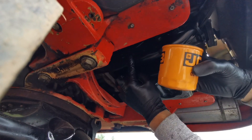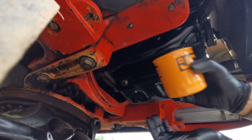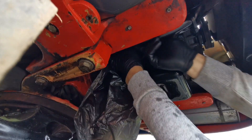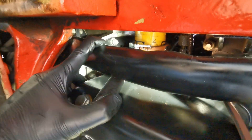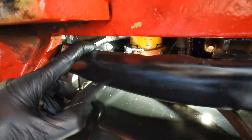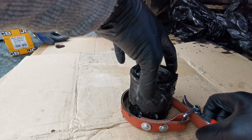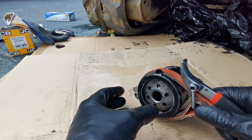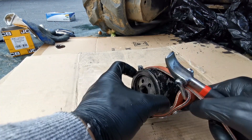Now I need to squeeze the new one through this tight space without making the seal dirty — it's difficult, so I'm going to do it in a bag. Regarding disassembling and assembling the filter: just look at where the thread is and how short it is. When you want to unscrew it, don't keep your tool far away — keep it as close as you can to the thread so it will feel more stiff.